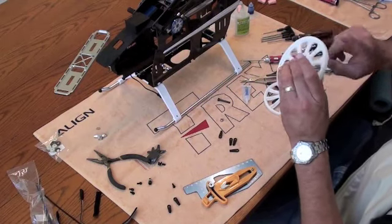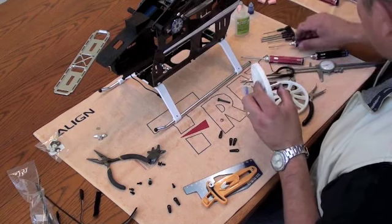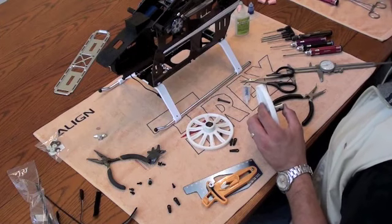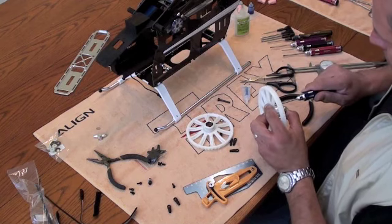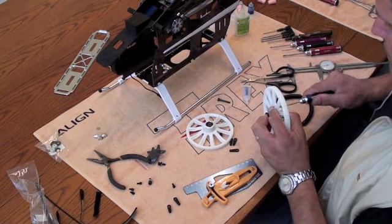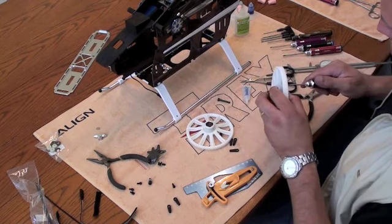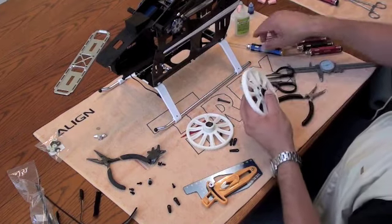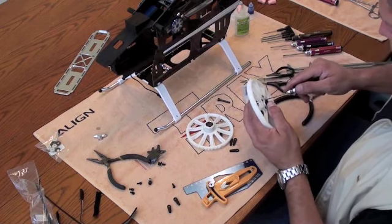Okay, nice and free. Okay, you want to check these screws. You can check these here. Let me put this there. My blue wrench is here. Let's feel these. These have been Loctited. Check them though. Just check the feel. Try and pull back just a little bit. That's Loctited. Again, this part, you can leave that alone. Check the main gear. Check the stop gear as well. Make sure there's Loctite.